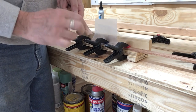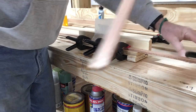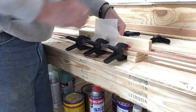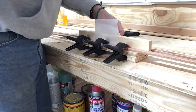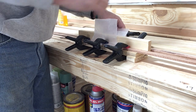So this is mahogany, and what I'm doing is I'm making an accent strip for the water line. I'm still 18 foot long, so I had to make two scarves because I had an 8 foot piece. And I ripped it out. So I did one scarf between the 2 8 foot pieces last night, and I'm just adding on the last 2 feet here now.